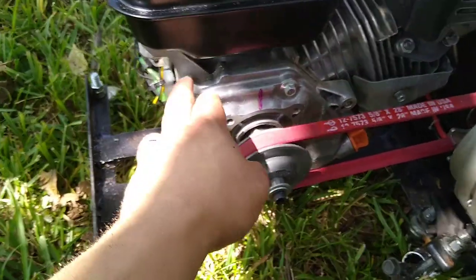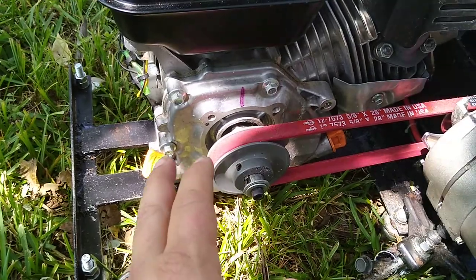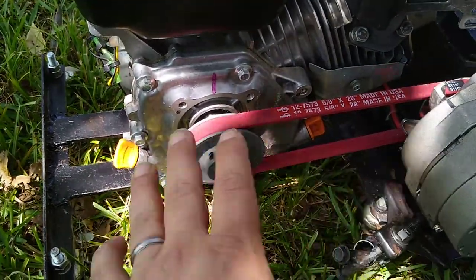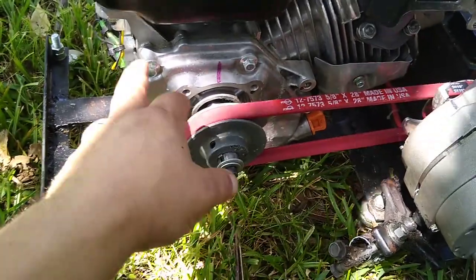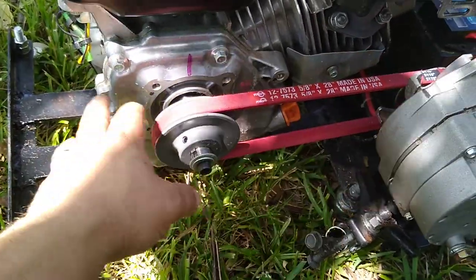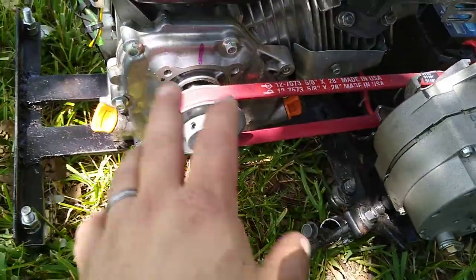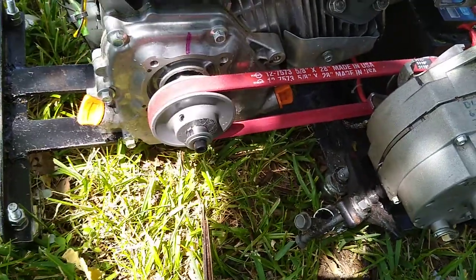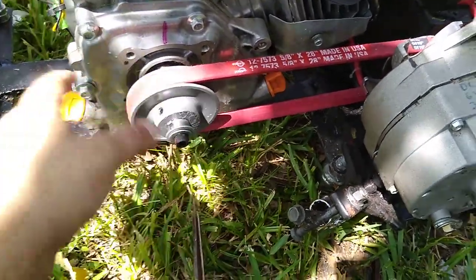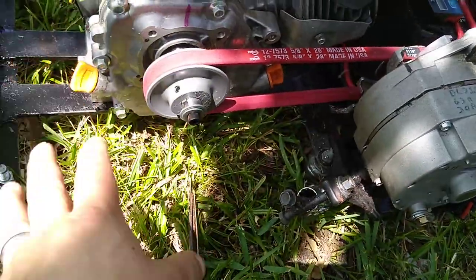For example, on the side cover, you'll find the torque specifications work fine on the standard setup. But let's say you upgrade everything like I did on the other engine. I torqued these down to the specifications, and of course, going in a pattern, did everything properly. The bolt started to come loose. Luckily, I saw oil dripping and shut it off before anything went terribly wrong.